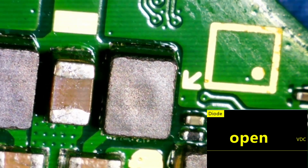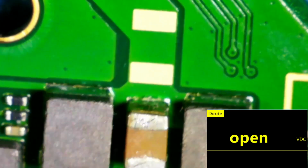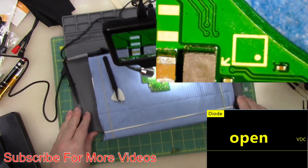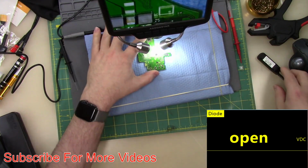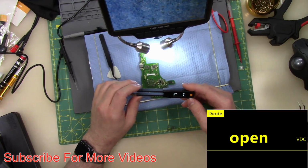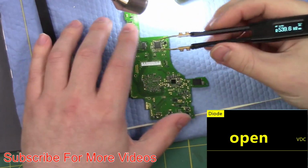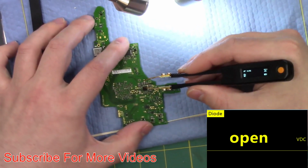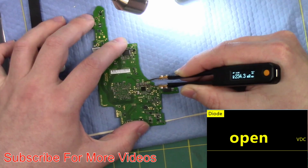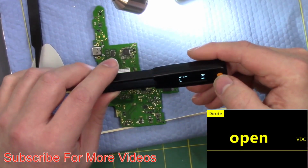But I looked at the cap and I'm like, okay, well, is my cap shorted? I don't think my cap is shorted, because if I go back to this, I'm going to have to slide this and take the microscope off. So if I come back to this cap with my LCR meter here, in resistance mode, and I check this capacitor, it's going to read 164 megohms. It reads megohms, so I don't think the direct short is across the capacitor. It even measures a series capacitance.